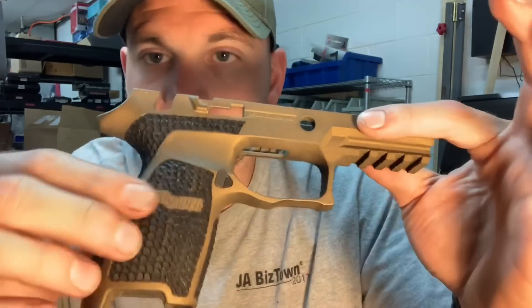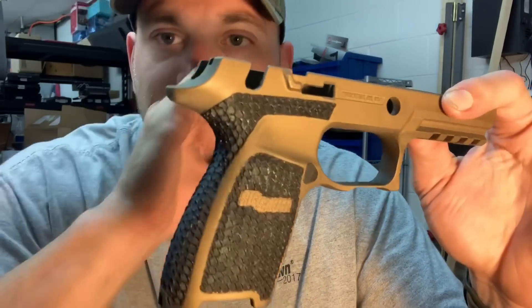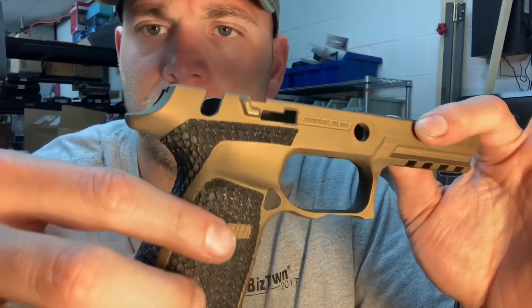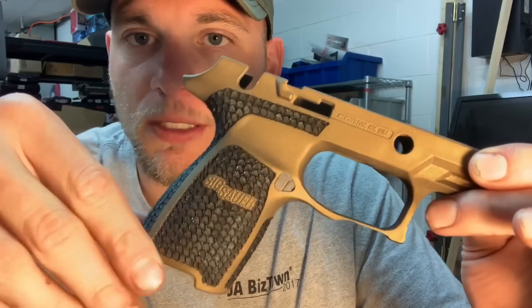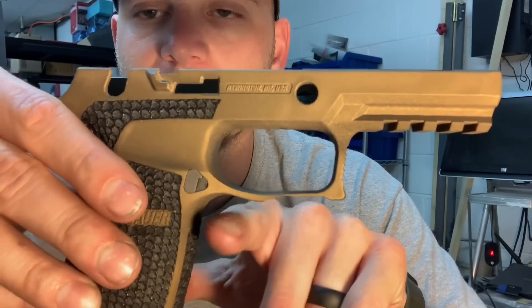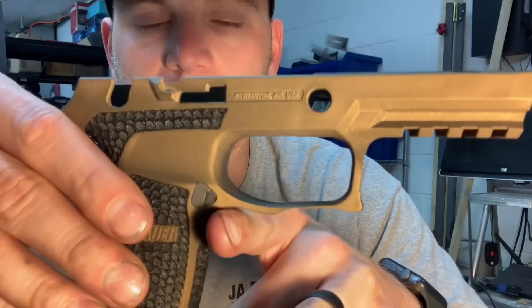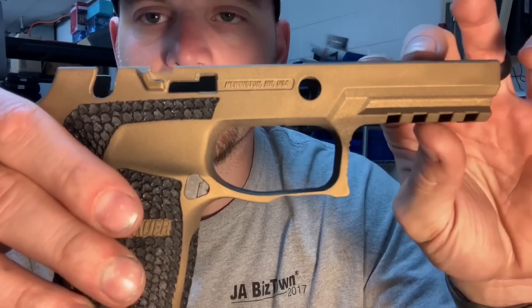Got this SIG finished up — voila, check it out! I'll run through the details. I didn't time-lapse or show the stippling footage, but I'm pretty sure I've shown the gator technique before. So this is burnt bronze cerakote, single undercut. I don't do a double undercut on these SIG frames because your hand already gets a pretty high purchase in the back area against the grip, and you don't have a ton of material to work with in there.